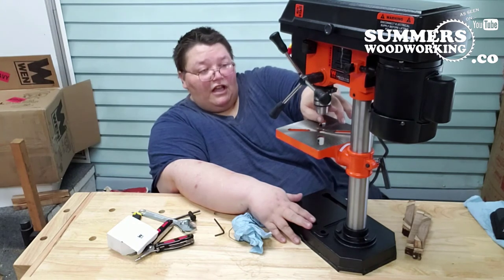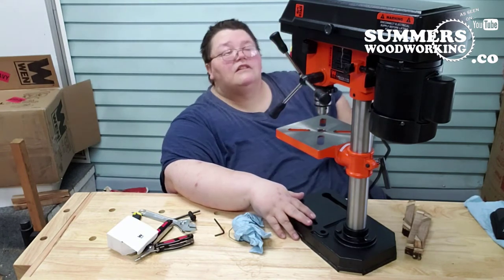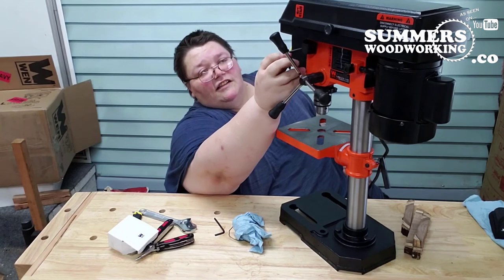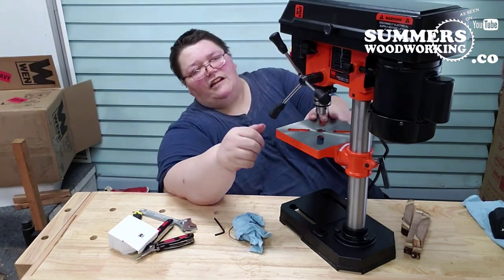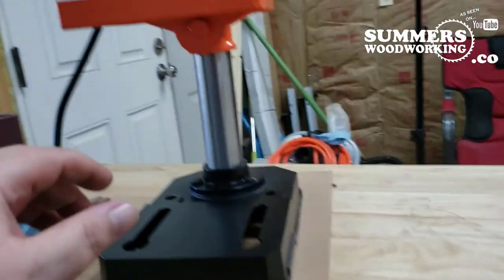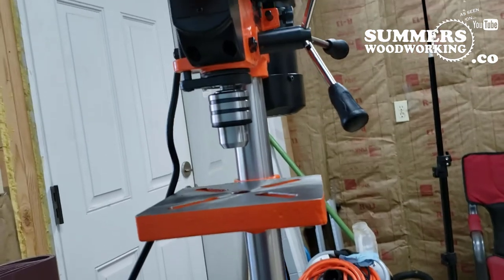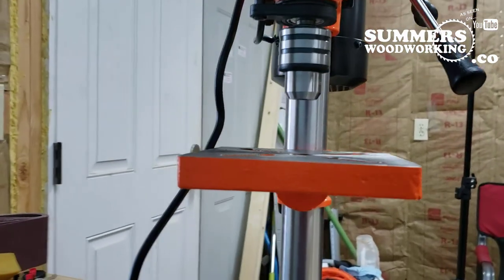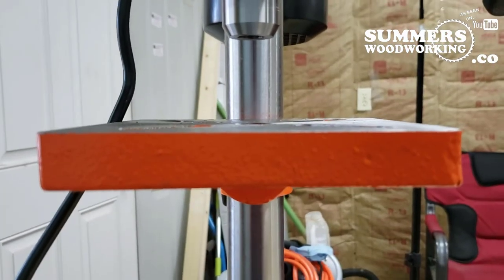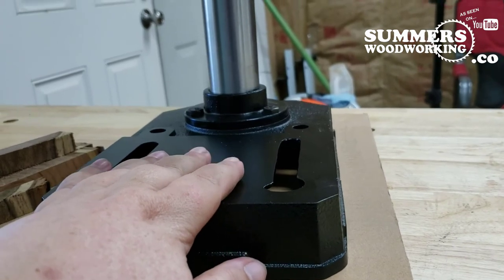Being a turner, I can tell that this is running true. They've got a little spot here where you put your chuck key in — like so. This is what I mean by dampening the sound: I just put a piece of cardboard underneath it, and now you can hear how much it cuts down on the noise — it's much quieter. No runout, table's nice and flat. My only complaint is this base is a little light and you can feel the vibration through it.